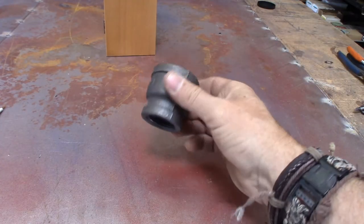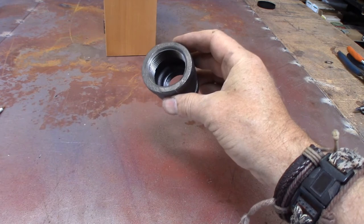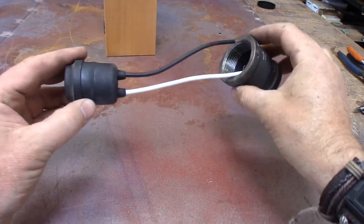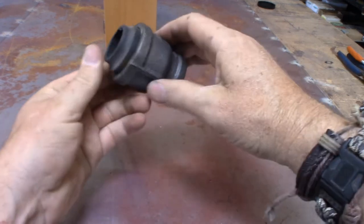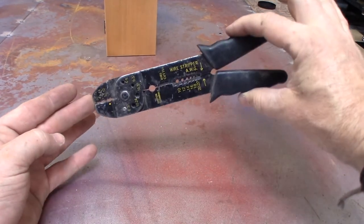Now, here's kind of the creative part of it. You'll want to pick up some black pipe or galvanized pipe. This is a length of 1/2 inch gas pipe. Now I got the black, I think this is maybe 18 inches. All right. You'll also want to get an adapter that goes from 1/2 inch to 1 inch. After that, you're going to need a reducer. You have 1 inch up to 1.5 inches. Now, this is why I ended up getting this, because when this goes down in here, it fits very nicely in this piece.